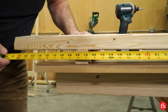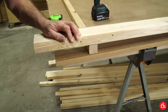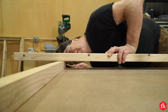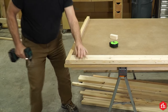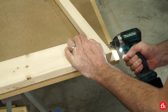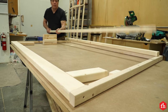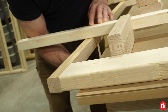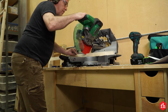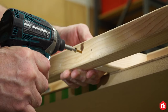Now, move the bottom board to the height of your front and back wall. Make pencil marks on the 2x4s then cut them to length to match the front and back wall. Attach the two 2x4s to the bottom board first, then attach the top 2x2 to the 2x4 stud. Cut yourself some spacer blocks to put between each stud, and cut a riser block to set your stud on as well. This will make laying out the studs much easier. Then make a mark and cut it to length. Repeat the process for the remaining studs and attach with 3 inch screws.